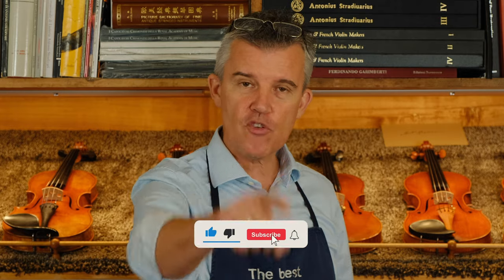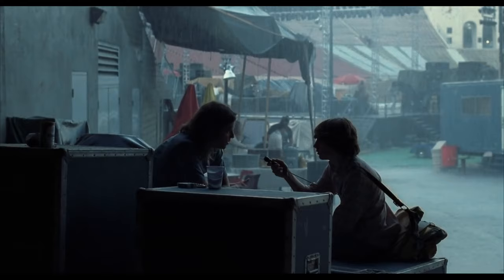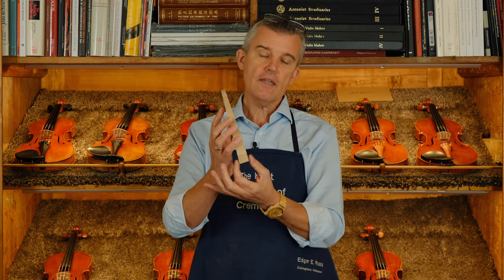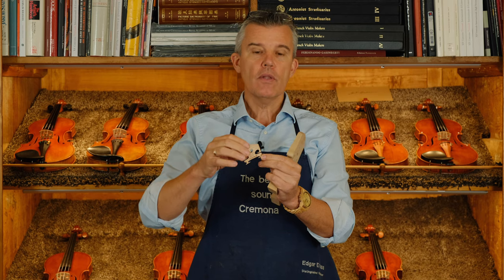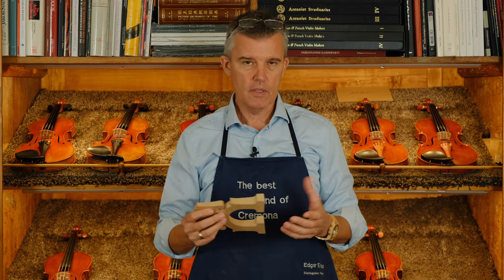To know more, subscribe — thank you very much. Here I have a double bass bridge to show you better — finally the bass players are happy! This is a raw bridge, and the first thing violin makers do is bring it to the right thickness. We mainly adjust the back side — the side facing the tailpiece — and we adjust the thickness of the feet. Where the two arms are, we try not to plane anything, in order to keep maximum strength. This is the first ingredient to prevent too much bending.